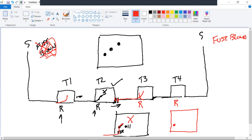Have an indicator here through the transformer and out. That's this situation right here. And out. Red is looking at the transformer and the cable that comes down to the dead end. Gotcha. So this one's going to be real easy to isolate, isn't it? Yeah, and you just take out T3B. Yeah, you take out T3B, dead end it. This one's already dead ended.